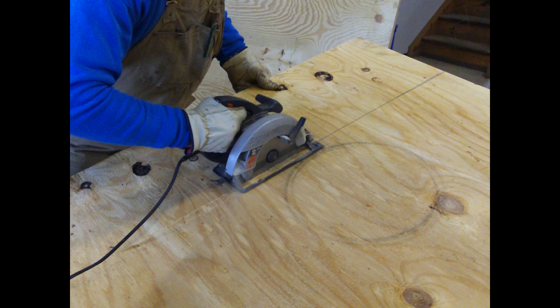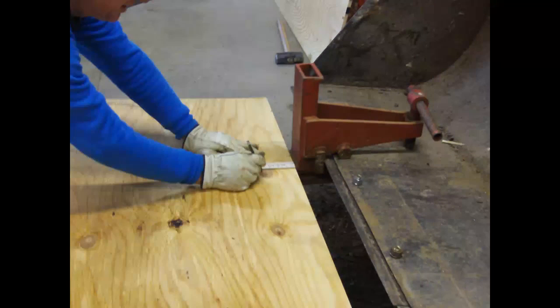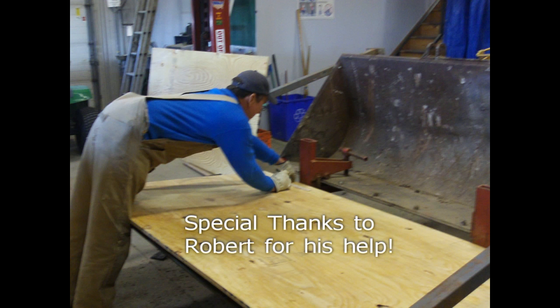By utilizing plywood for the surface, we cut our costs basically in half instead of using steel. We had to notch out the areas where the pallet forks were attached to the bucket so that the wood would rest up against the original cutting edge on the tractor bucket itself.